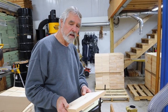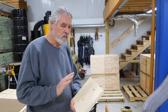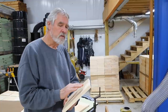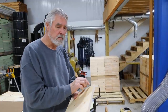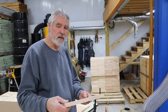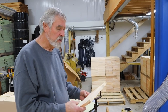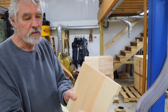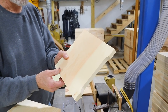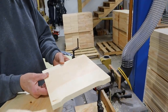Normally a deep box is 9 5/8 inches deep, and we're making these nukes the same as a deep box and a normal bottom board. So what I've done is made the sides and the ends 10 inches. It gives us an extra 3/8, which would be the strip I'd normally put on a bottom board. And we're cutting the entrance out 3/8 of an inch, so that 10 inches works out just perfectly. I'm using this shaper to do it. This works really well for making these entrances.